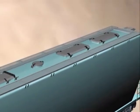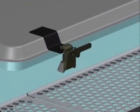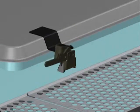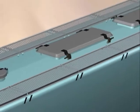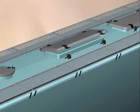The IRECO 30169 is a hatch cover lock that also functions as a hinge. This offers the flexibility to open the hatch cover from either side of the car. Once all of the locks on one side of the car are opened, the hatch cover will be hinged about the closed hatch cover locks on the opposite side of the car.